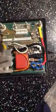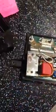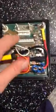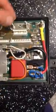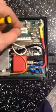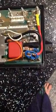So what I had to do then is have a look at this. I took the cover off whilst the unit was mounted to the C5. Then you can basically just inspect all the plugs and fuses. I checked all the plugs were on fine, made sure the orange one and the purple ones — all the wires were attached properly. I had a look at the fuses, testing with the voltmeter, and those were all good. Everything sort of looked fine on this.